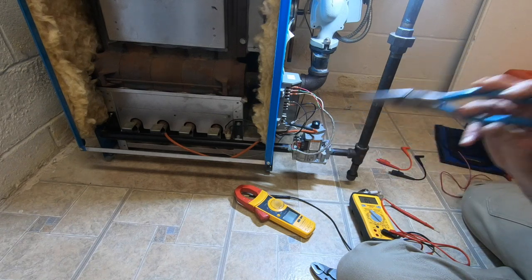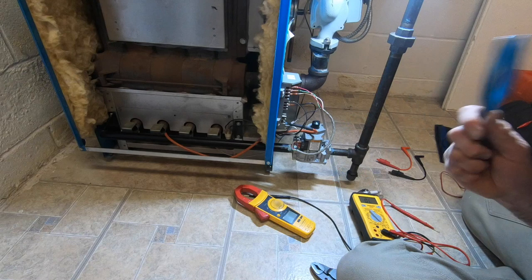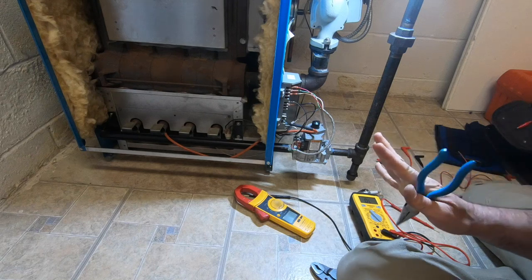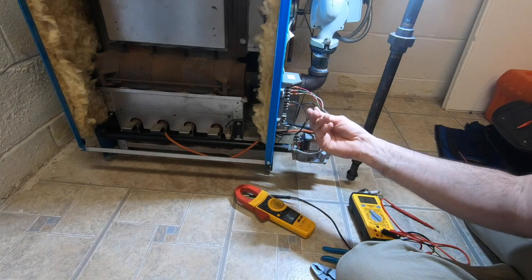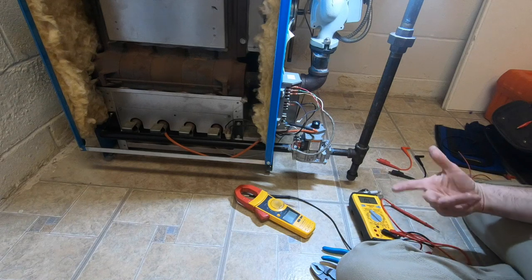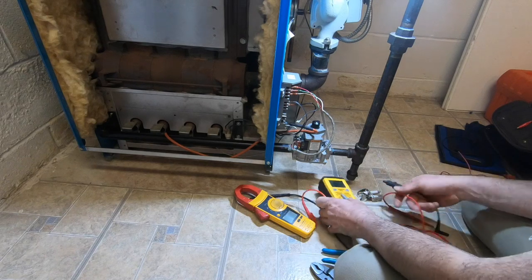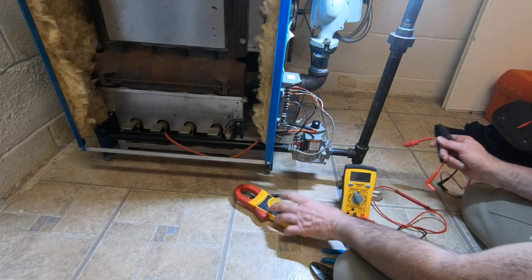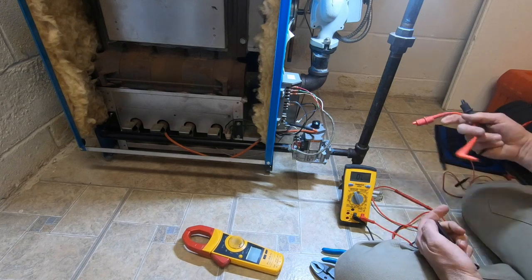The burners were dirty, they were plugged up. There were several different things, but the actual thing I'm believing is that my ground was slightly dirty. And I'm still thinking at times my ground may be no good. Like there could be a slight white film in here I'm not seeing. It could be anything. But my biggest problem is every time I put my meter on anything, I get the same result. I test good on the ground. I test good on my flame sense.